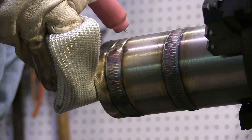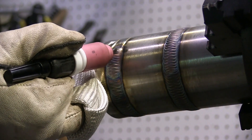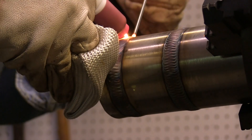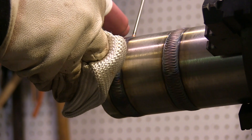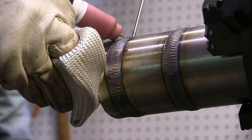There are times when stuff is in the way and you can't walk the cup. On this particular one, out on the end, I didn't really have anywhere to prop. I've got a TIG finger on — shameless plug — but it really does show that you can prop right next to a weld and make a weave almost as good as walking the cup. Sometimes there's just another pipe in the way, you don't have the freedom of movement, and you just have to freehand. When that is the case it sure is good to have the prop in your pocket — I've been right on that hot stainless for a good minute and I'm not even in a hurry to pull the gas off. The fingers aren't even warm.